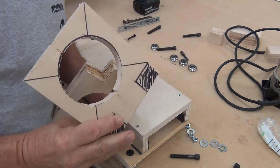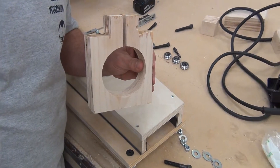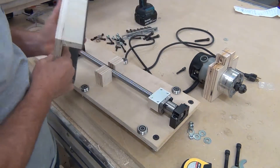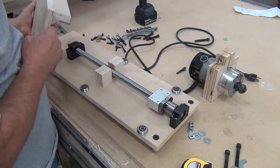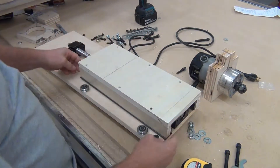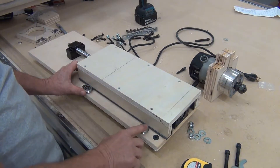Originally I was going to do a different design, but I had a piece of glue-up and that's what I ended up making for my bracket for my router. To determine the height of this side with the angle iron mounted on it, I know that from here to here is two inches, so I made two two-inch blocks to set this right here — and that's how I know it's going to mount and I've got the right height from the face of this bracket, which is perfect for where the V-groove bearings are going to sit.